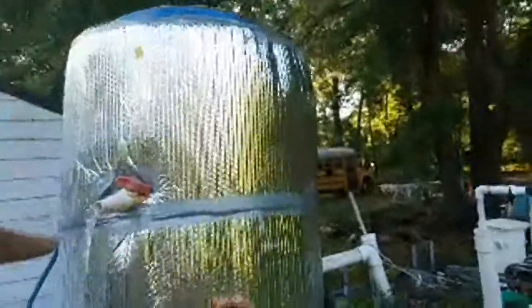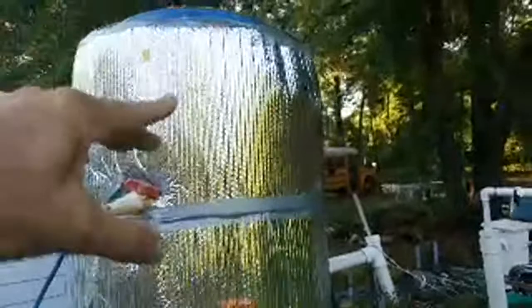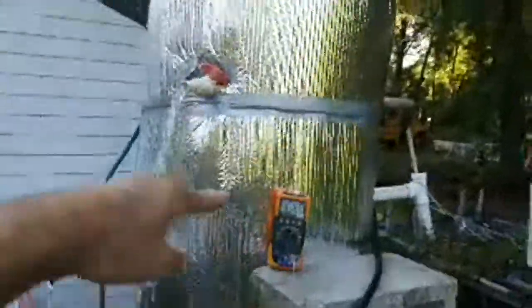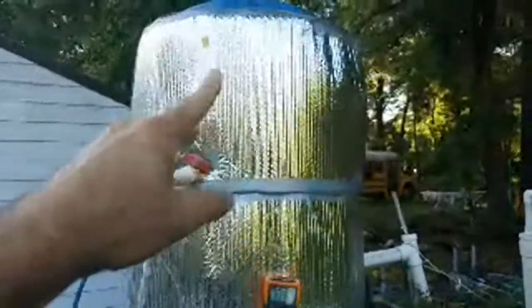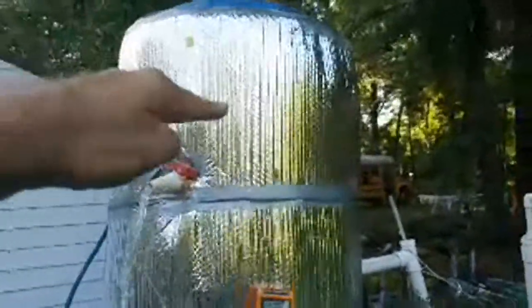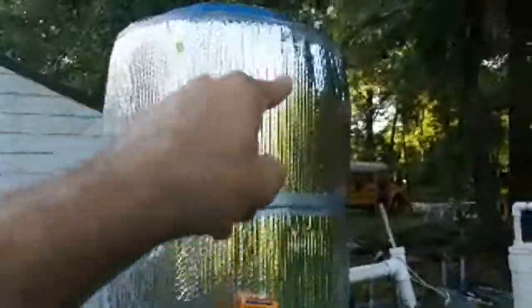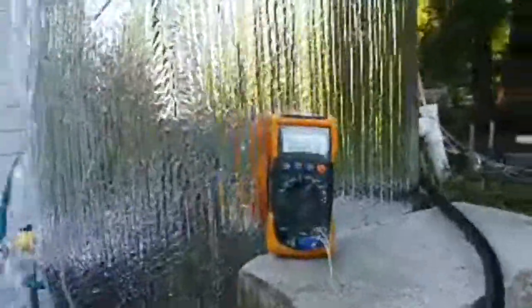And then as we opened the valve, the water was slowly coming down, and of course the coolest water is down at the bottom, and over that valve there was water that was about 120, 121, 122. That we used up first, and we were getting down toward the hottest water, but then the float valve opened up and let cold water in down the pipe, which was pushing the water back up, but it was also mixing, so we started getting some lower temperatures.